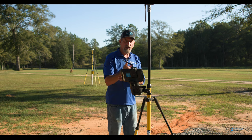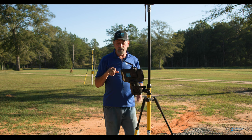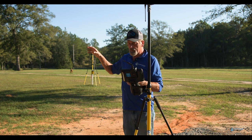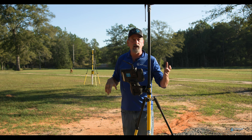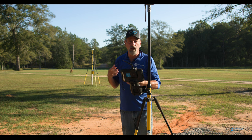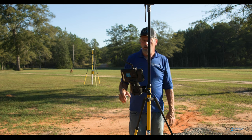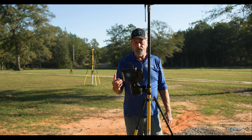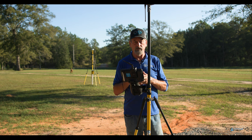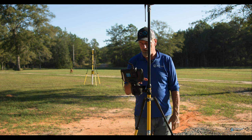Okay, so there's that. So the big goal here is to be able to stake out everything I need to stake out. But if I come back, can I get back on the same projection? Because I'm not on state plane coordinates, I'm on a different projection. So at this point in time, I've done my projection. So do I stake out? I wouldn't. I would do what I'm fixing to do right now, but I am going to show you something.